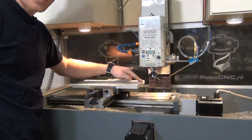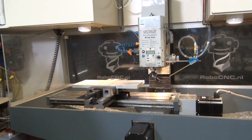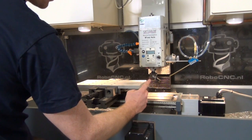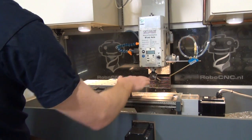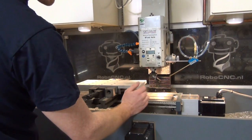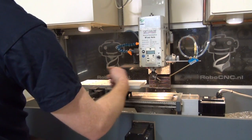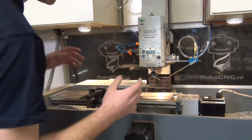We found out where the top of the material is and I zeroed the Z axis. The speed of the cutter is 2000 rotations a minute. I'm going to set a depth of cut of 0.2 millimeters — I just want the finish, I'm not trying to get exact dimensions. So I'm going for a 0.2 millimeter depth of cut and a 100 millimeter per minute feed rate, which is not that fast, but I want to try to get a great result on the finish.